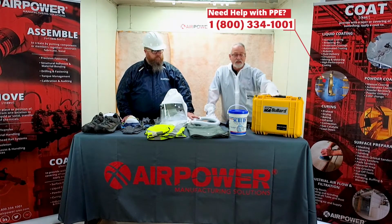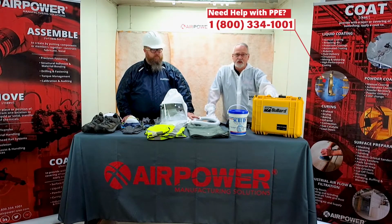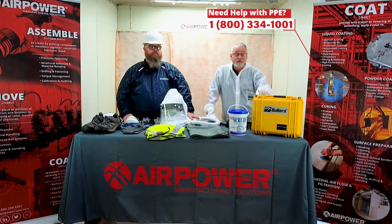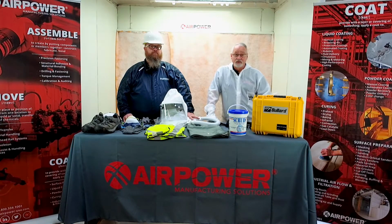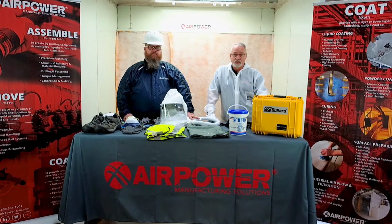This fitting that comes out of here, it's a quick disconnect, just like you have in your shop for your tools and everything else, your blow-off nozzles and all that. It cannot be the same as anything else in your shop. Your shop may have, for an explosion environment, for whatever reason, may have nitrogen hooked up that you run tools into a certain location. You wouldn't want to hook yourself up to nitrogen. There's no oxygen there. You're going to pass out. And if nobody's around, you're going to end up being there and you're going to die. So very important that this quick disconnect is totally separate than anything else in your shop. It just depends on what you have in your shop. Talk to your account manager. Let them help you choose that.